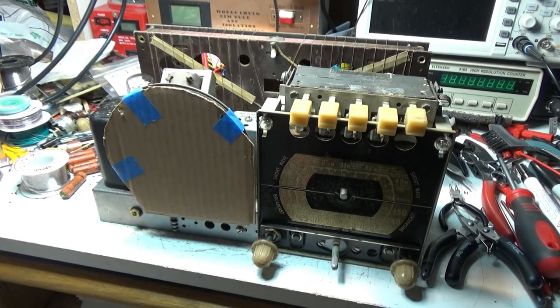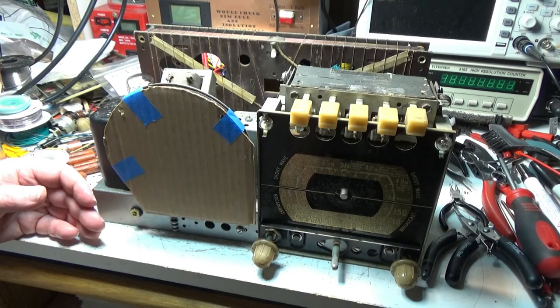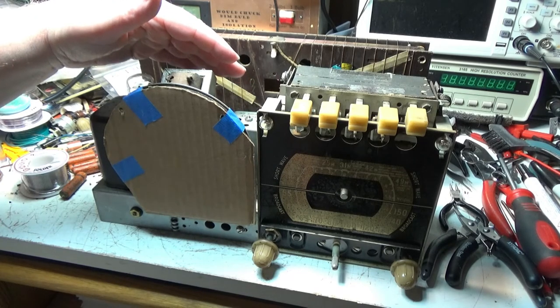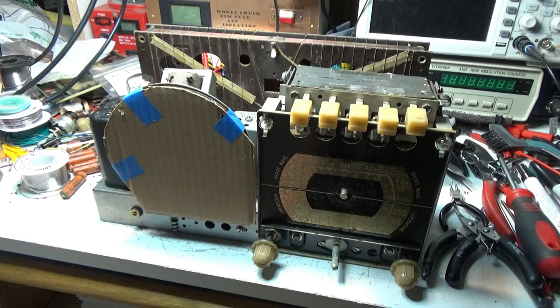Generally, you would have just another electrolytic, right? You would have two different electrolytics in there. But they didn't have room underneath. You've seen how jam-packed the underneath of this thing is. So they had to put it above. And I'm not sure how they kept it from... I guess it would have had two common terminals on it. I don't know how they marked it. I'll have to look in that other old radio to see what that electrolytic looks like.